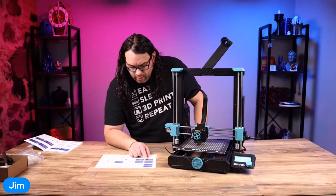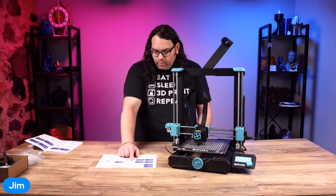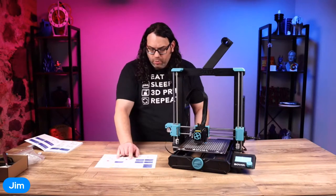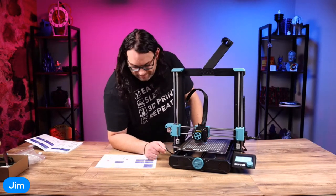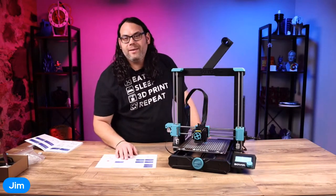After clicking auto home the first time, the machine will be preheated automatically. The nozzle at 120C, the hotbed at 60C. The first time after the temperature is reached, click auto home again to proceed. Oh, I probably shouldn't have hit proceed until it was heated up. So there's that. Should read directions, right?